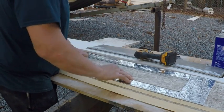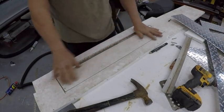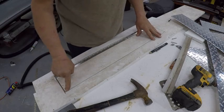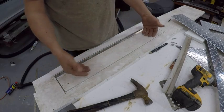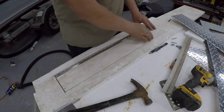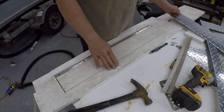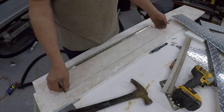We've got our doors made. One thing I just got done doing — I put my hinge on. If you'll notice, I've opened it up a little bit. This backer piece really doesn't matter if it's perfect because it's just a backer for the door. Because I don't want to have to put a stop underneath it, what I've done is just ripped a half inch off the end of this and re-secured that to the front side. That gives me a little bit wider gap, and you'll see in a minute why I've done that.